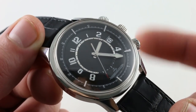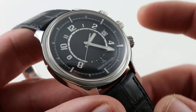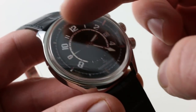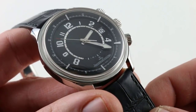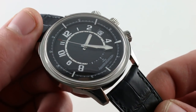What's inside also counts: it's the veteran bi-directional rotating, 45-hour power reserve, 22-jewel JLC caliber 918 automatic alarm. It's very loud and vocal, with about 20 seconds of duration from a full wind. It's a tough, old-school movement — though in some ways a little too old school. The quick-set is actuated by rolling the hour hand back through 10 PM and through midnight as many times as needed to toggle the date. It has a semi-quick-set function like the old 916 that inspired it, but it is a tough, hale, and hardy caliber worthy of a sports watch.